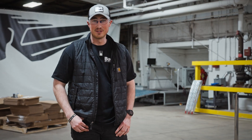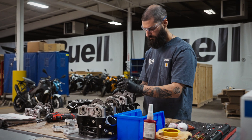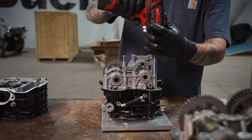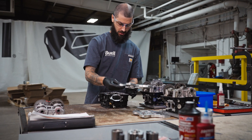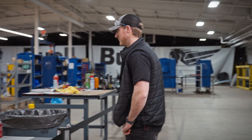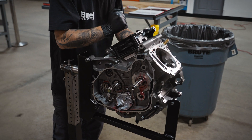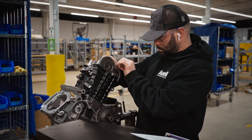We just hopped off the production line. We have a sub-assembly area that feeds directly into it. This sub-assembly area produces about eight different sub-assemblies that will be installed on the engine later on. We are assembling the cam towers for both the front and rear cylinder, along with the front and rear cylinder heads. After the subcomponents are done for the cylinder head and cam towers, we'll go back onto the line section where we do the rear end and front end buildup. This consists of the cylinder, cylinder head, and cam tower. This station is also where the valve lash is originally set and then handed off to the timing station for critical checks and potential valve adjustments.